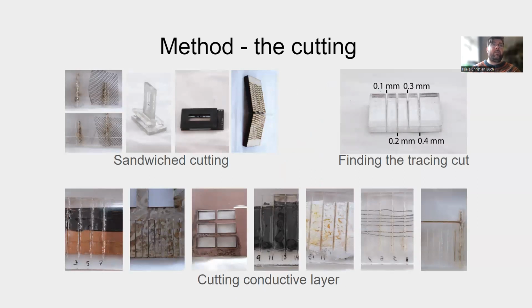To create LaSir, we have been exploring a lot of different materials and thicknesses, using different speeds of the laser cutter to find out the most efficient way to cut through the material tested. Going too fast leaves the material without proper bond, or not being able to cut through the conductive material at all. To make a trace cut, we tested multiple cuts and found out that 2 close cuts are effective at cutting the connection.